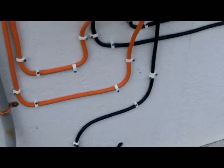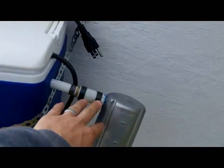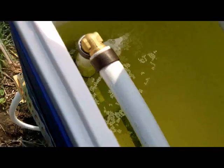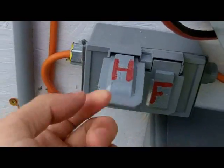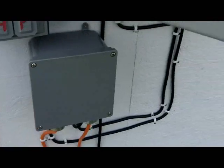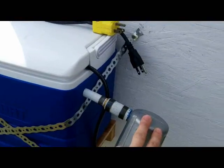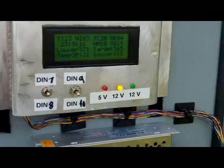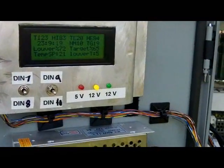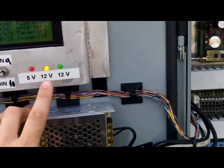This one also has a ground temperature sensor buried in the ground, and it has a heating system — just a block heater for a car, a little pump, and some glycol, wired up to a socket with a big 20-amp AC relay. If the ground temperature is below a certain set point, it kicks on the relay and starts circulating and heating up the ground. That's kept separate from the ambient louver control, because the ground temp could end up cooking the roots.